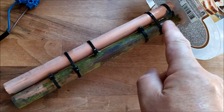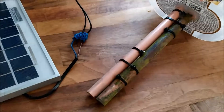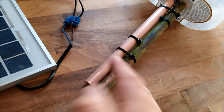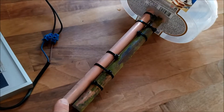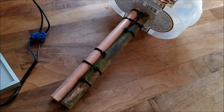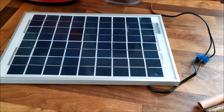You've got cable ties to hold the two pipes together against each other. I might change this connection here and put a three-way switch in so I can just switch it over and change the polarity. You can see one electrode will be clean and one will be dirty, and if I swap the polarity over then this one will be clean and that one will be dirty. So it makes sense to add a little switch to keep them even.